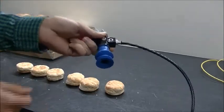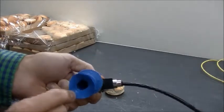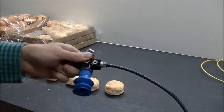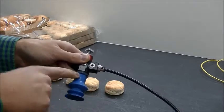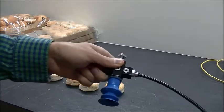Another unique feature is that the cup has rounded edges on the bellows as well as on the inside of the cup. That prevents any hard creases where product could get stuck. The fittings on these are also available in stainless steel or composite plastic — both are acceptable for FDA.